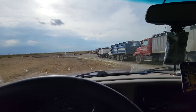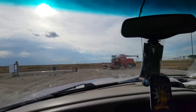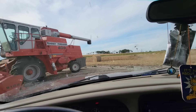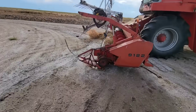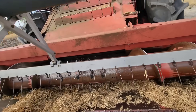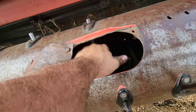Well, we've been combining for a little while here but the 860 broke down — kind of a funny foul-up here. The feed fingers are held in with an R-pin and the R-pin either broke or fell out, and that allows the feed finger to fall down into the holder too far. Then it got out of its holder, came around, bent the heck out of this feed finger, bent itself in half, and then it came through the door and broke the bolt so now I can't get it out of there.